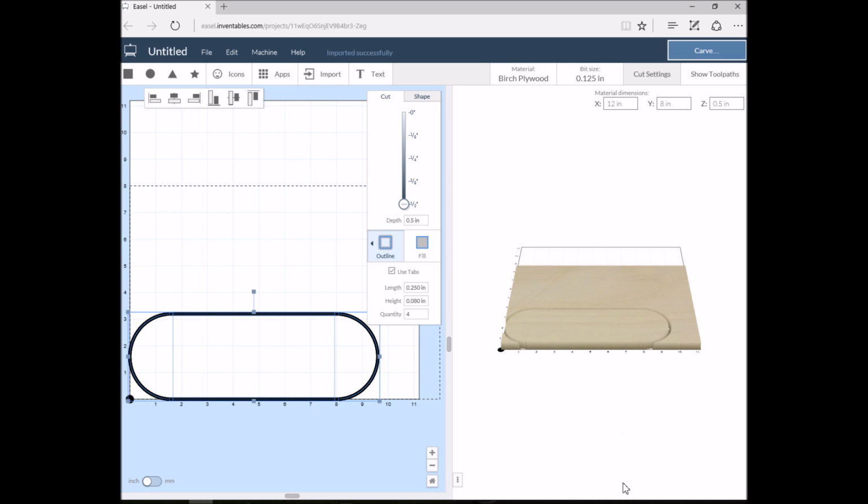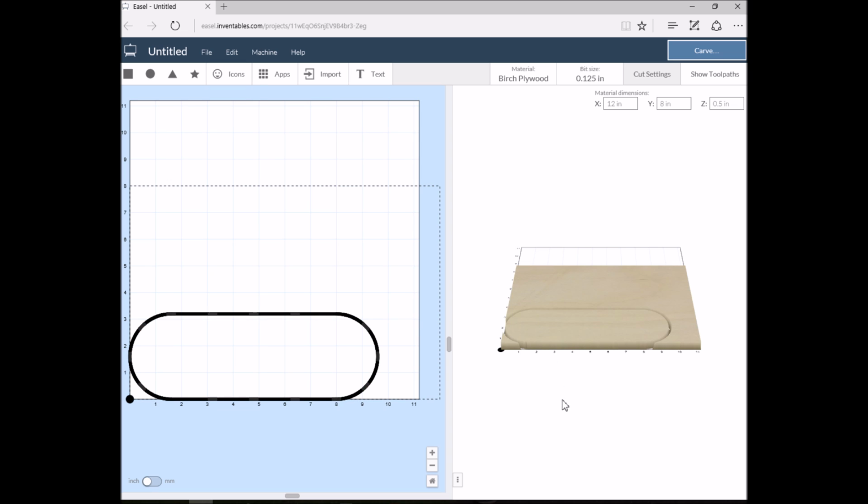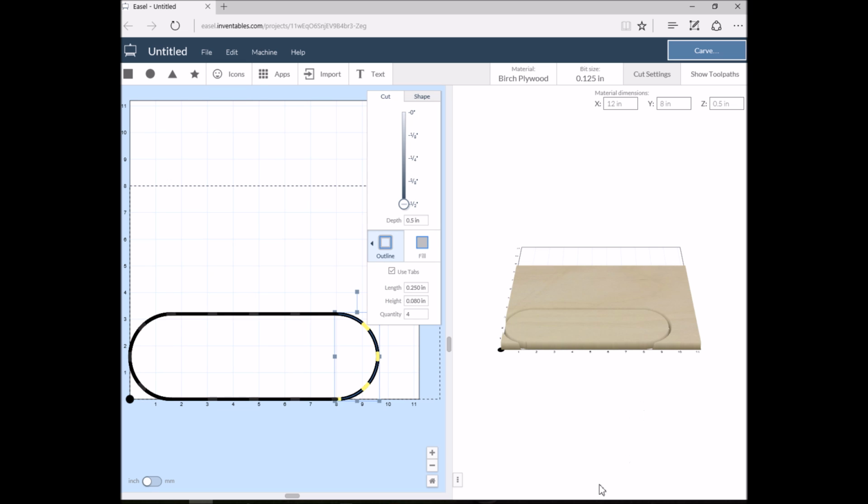Here it is. It's not the right scale, but we knew that that would be the case. Let me see if the arcs, and look at that. It's separate pieces. It did not work. So I have not found a solution to this problem. What I found is that arcs make all the difference. If you're converting from PDF, the lines will all be one piece, but the arcs will not be part of the lines. And that's a problem I have not solved.